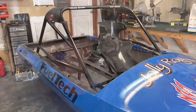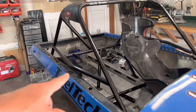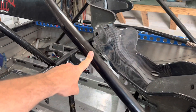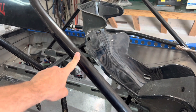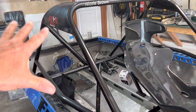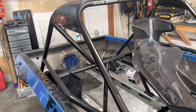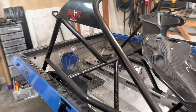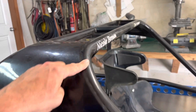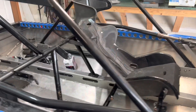I'll spin the phone around and we're going to talk about the roll cages before I pull that cage out of the 907. The basic premises are that all of the tubes have to be inch and a half chromoly and 083 wall. That's the basics — every single tube in here is inch and a half chromoly tube and 083 wall.